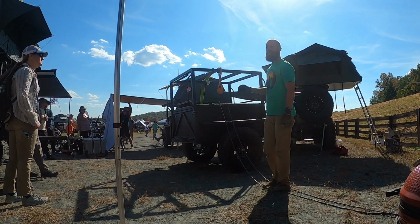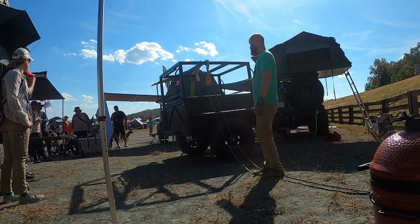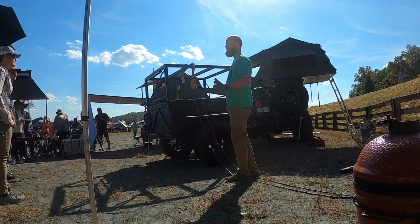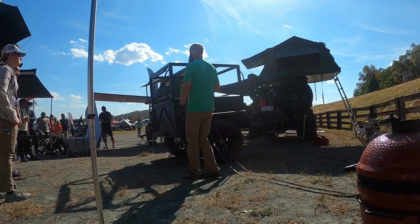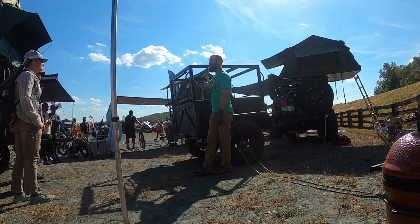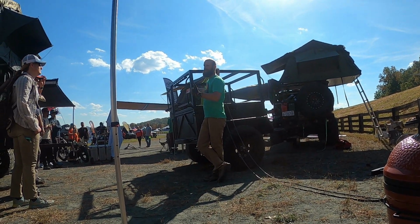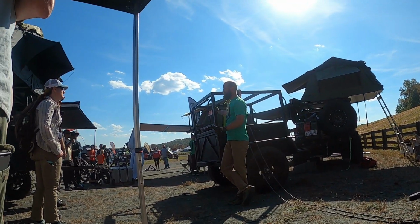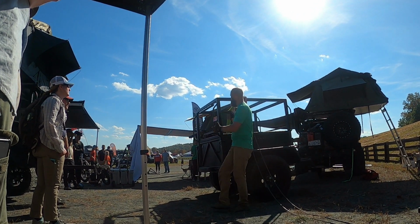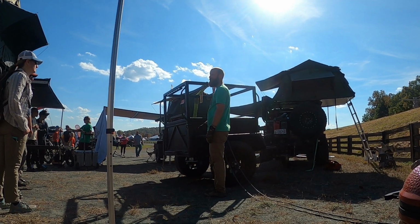Cool V8, loud, right? But before I start breaking all this down, I want to inspect everything, right? If I'm even concerned that maybe this trailer could roll again, because it's probably in the same position it was before, right? Then I'll keep that winch line on there and I'll keep it tight to keep tension up on it until I get this trailer to a safe spot. We can pivot it around and drive through a little bit, letting the winch in and out to control that.